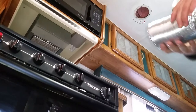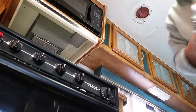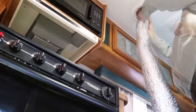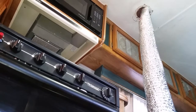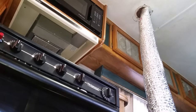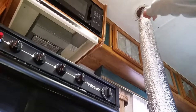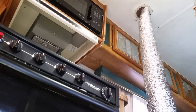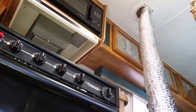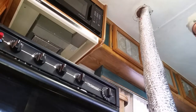What I'm trying to do here is run the dryer hose up into the ceiling. We're going to turn the thermostat up a little bit, get that furnace to come on, and we're capturing the air from the heater, running it up this dryer vent hose and into the ceiling. I'm hoping that by filling this cavity up here with heat, it will dry out that ceiling.